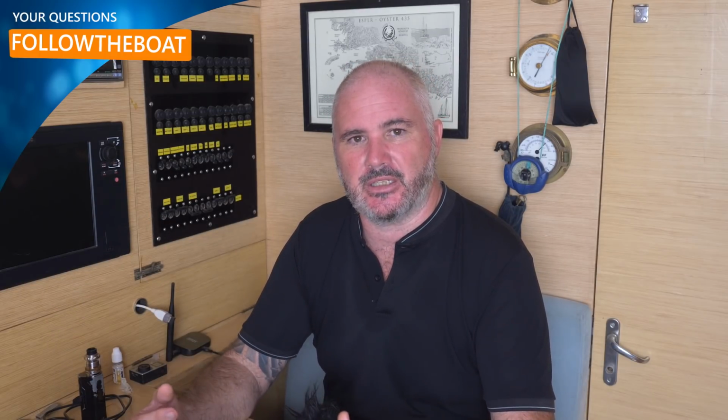The idea really is to know where you want the anchor to lie and where you want the boat to lie. Obviously they're going to be in two different spots. So this is where the whole timing technique comes in. If there's two of you, it's useful to have someone on the bow. That person on the bow can do two things. The first is if you're in clear waters, you can actually see the anchor go down and see where it lands. The second thing is they can count the chain, because what you want to do is lower the anchor down, and as it hits the seabed, you want to put the boat into astern.